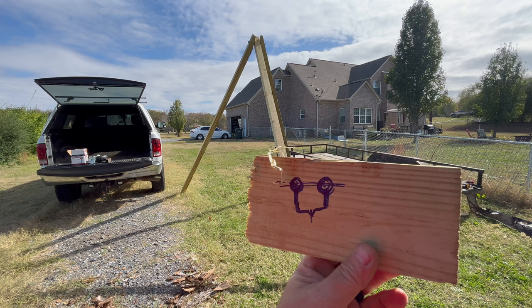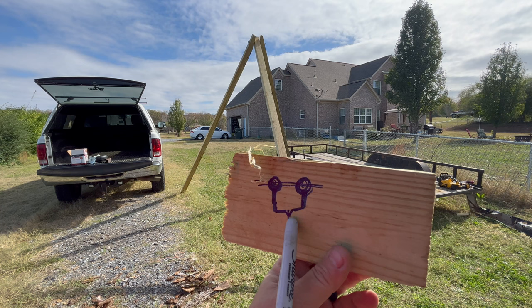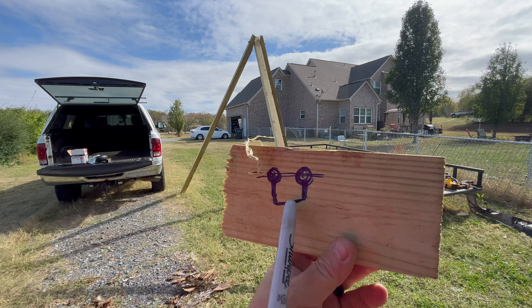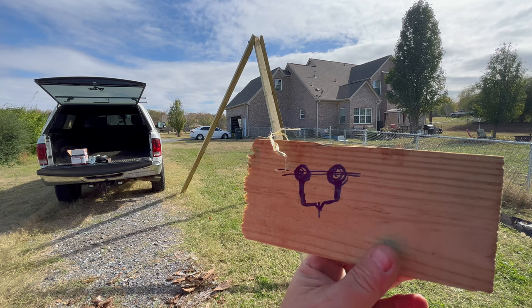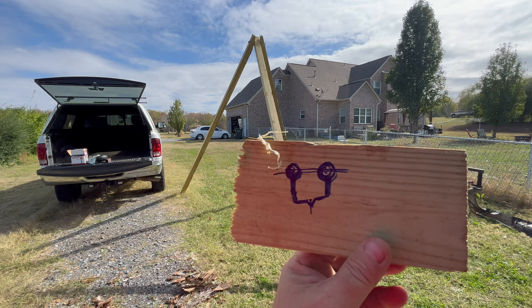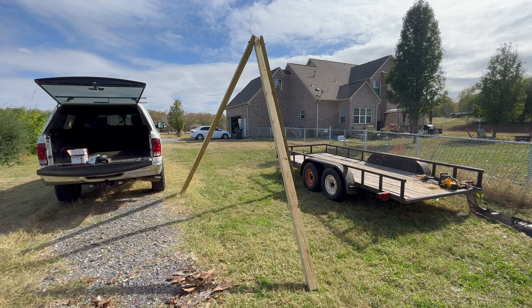So it'll hang down off the main bolt, have a little jog in it to hold a hook that's gonna hold that chain fall, and then go back up. So this way, all the weight is on that bolt, which is transferred to the legs of the tripod. Hopefully that'll work. Anyway, stick around. I have this blacksmithing work to do. That should be fun. But all in all, I think I'm pretty happy with that.